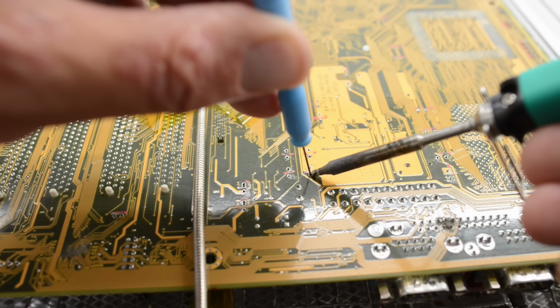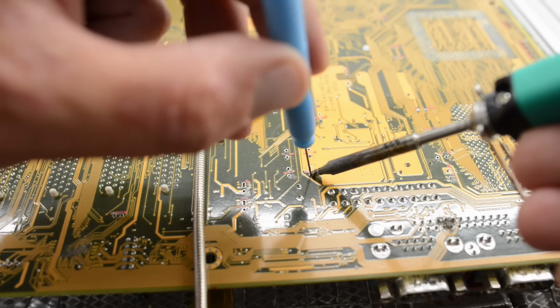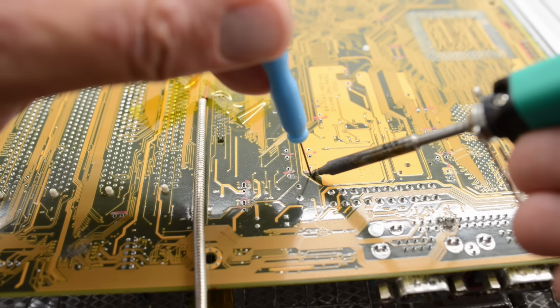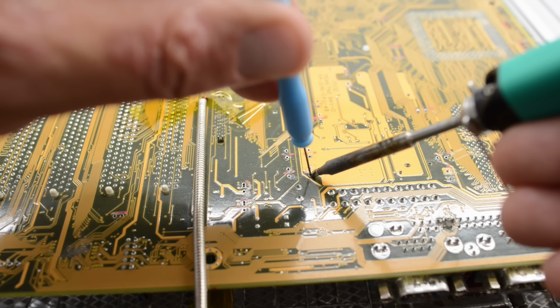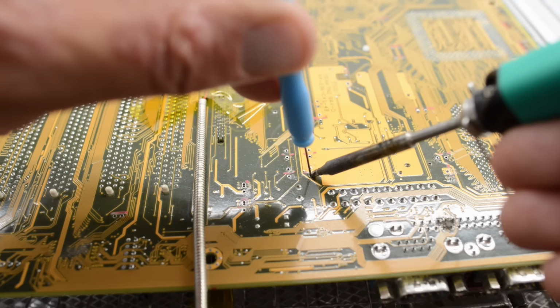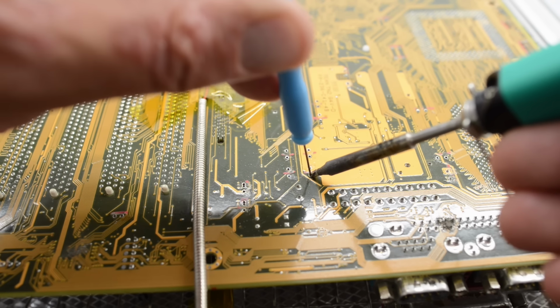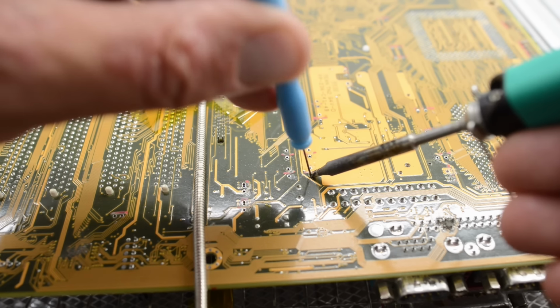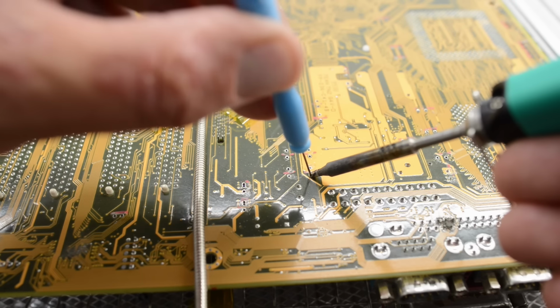All the through holes, except for these two guys here, cleared out really nicely. But for some reason these two are really stubborn. So let's try with some desoldering needles and see if this helps. These are just stainless hollow needles, and they are designed to remove solder from really stubborn through holes. But apparently that's not enough for this board.